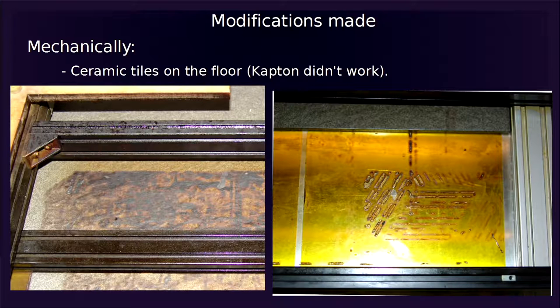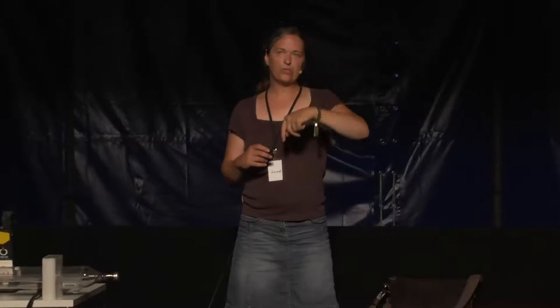There's compressed air through the tube, through the lens and nozzle, so no fume gets onto the lens to make it dark. It also blows away fumes and cools the spot where the laser beam enters the material so nothing ignites — heat plus wood plus oxygen equals fire. The beam goes through the wood and leaves traces on the ceramic tiles.